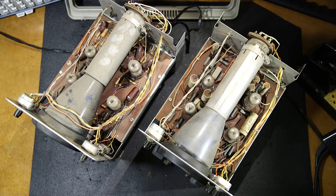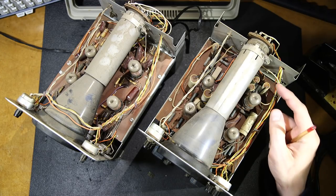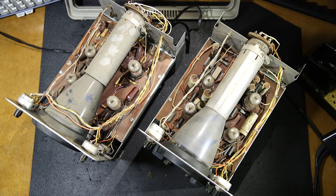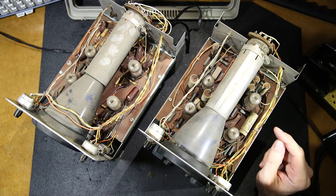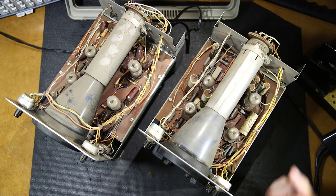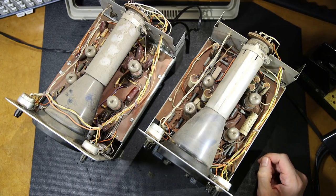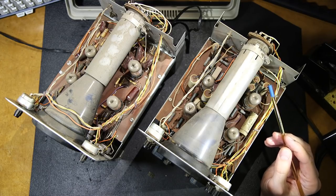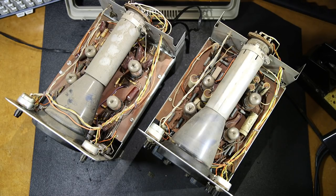And that's why in that test that we did earlier when we used the capacitor tester with the eye tube in it, you'll notice that these capacitors here, the one that we tested here, takes longer for the eye to open. So effectively, it's taking longer for this capacitor to charge. And the reason that it's taking longer is because it's developing resistance inside. It's turning into a resistor. Whereas you see the brand new capacitor, when we use that Illinois capacitor, that yellow one, you'd click the switch on the tester and the eye opens almost immediately. That's because it's not really turning into a resistor like this one here. So the resistance of that particular capacitor would be extremely high, the newer one. So not developing leakage at this point.